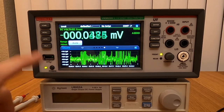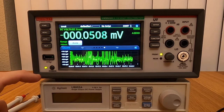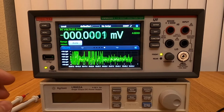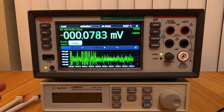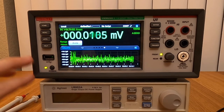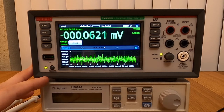Something else you may want to know, especially if you see this video in the future and get a second-hand unit: please make sure it has the latest firmware, because early units had a bug that was draining the internal battery. The problem is that you may lose the calibration data. So make sure the unit has the latest firmware — you may also get new features. That's especially important for this type of instrument, which is not so dumb anymore. There's a lot of processing power in it, and part of the reason the display is so reactive is that there's actually a dedicated processor just for the front panel.